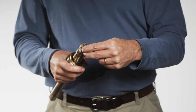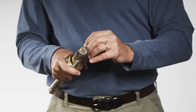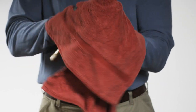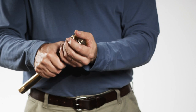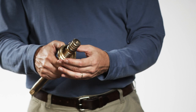Now we will begin reassembling. Replace the thrust nut o-ring. The thrust nut o-ring acts as a brake to prevent the disc from spinning when water is flowing through the hydrant. Do not grease the thrust nut o-rings. Wipe off any grease that may have gotten on the o-ring during assembly. Slide the thrust nut over the stem end that has the o-ring, and push the thrust nut over the o-ring to make room for the thrust collars.